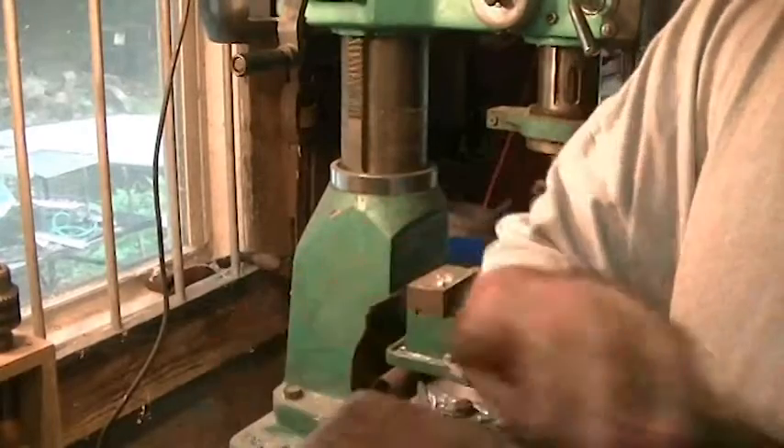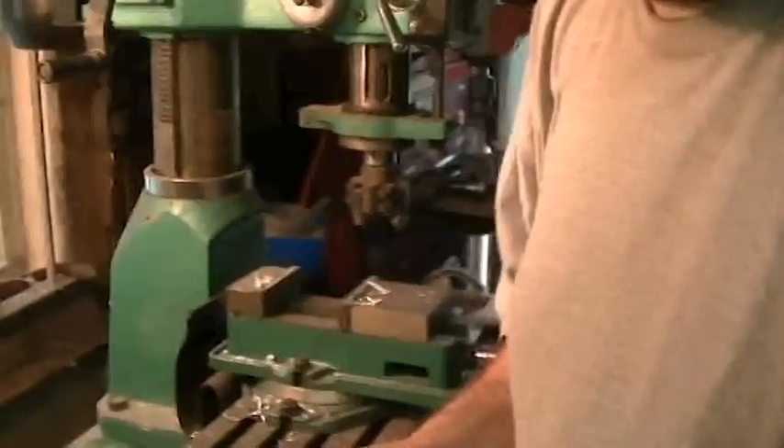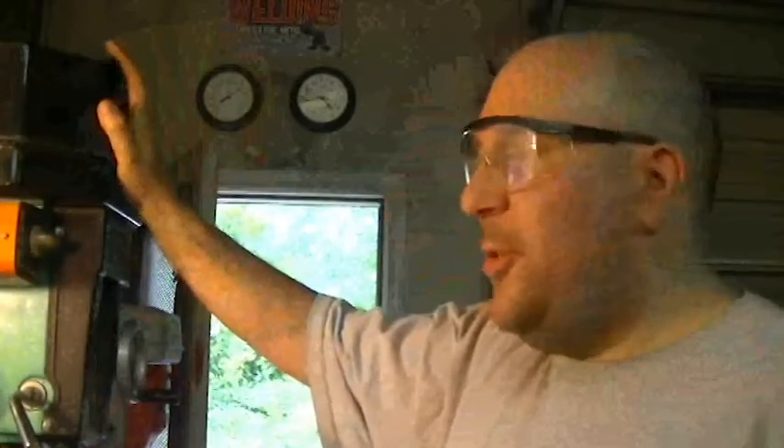I'll put this side face down and mill this side to make it flat. I'll be the first to admit I already made a rookie mistake. Having used Bridgeport milling machines for a long time, normally if you want to raise and lower the table you just turn a knee screw. With a small milling machine like this one, you have a crank which raises and lowers the head — the table doesn't move, it's stationary. I adjusted it for the block and forgot to tighten it down all the way, and the head started to pivot as I was starting the milling process. I didn't realize it until I started seeing the lines going crooked, thinking why is this thing so far out of whack? I know the vise didn't move. Then I looked up at the head and noticed it wasn't straight anymore. Rookie mistake, but I'm still learning this.